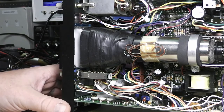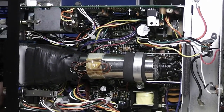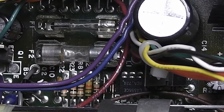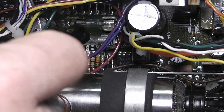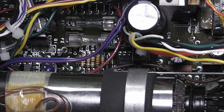The first time we fired it up it did nothing. I pulled the 12 volts off quick and started looking around. I noticed a fuse in the back had shot — the top one. They've got wires in the way but you can see it's not the right size fuse. This unit uses 32-volt, one-and-a-quarter inch shorty fuses. I didn't have one, so I replaced it temporarily with a 5mm fuse — it needs to be 2 amps and I had 5-amp and 10-amp, so I stuck in a 5mm one just temporarily.